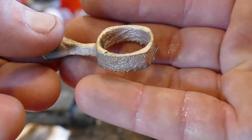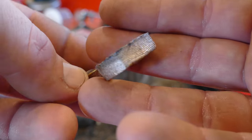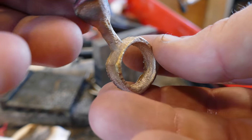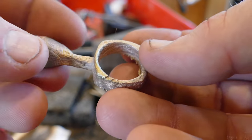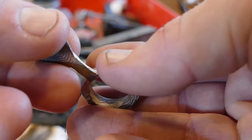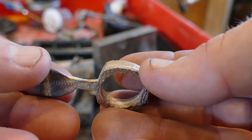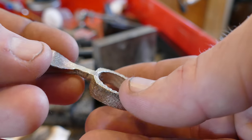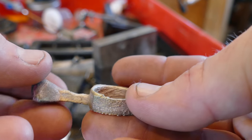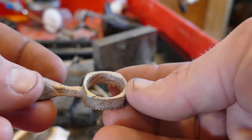Go wash it off real quick. Check that out — that looks really good. There's some cleanup we've got to do around this edge and obviously the sprue, but that looks really great. We'll cut this off and then clean it up. The lines that we sand away, we can take a file or a graver and engrave them back in — that's no big deal. Take a little tiny file set from Harbor Freight and you can cut those lines right back in there after cleaning it up.